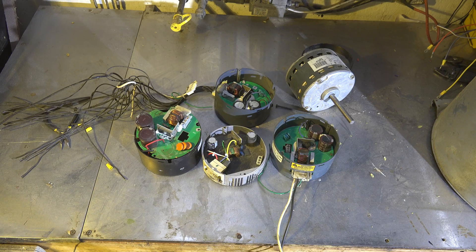I just got a comment on - well, several years ago I did some troubleshoot videos on ECM motor end bells. I've got a bunch of these end bells sitting here and these are not brand new, that's for sure. I never get brand new stuff, but there is a repair that can be done on these things. The issue you'll find when you come onto one is the fan motor just doesn't run at all. These are just fan motors, not inducers or anything like that, but a lot of times if it doesn't run at all it's a very simple little problem.